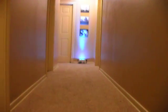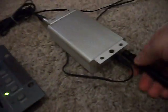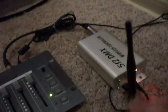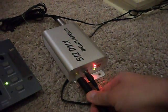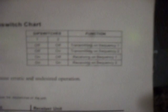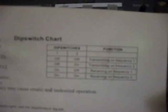As you can see we're operating the light. Now with the lights turned back on, I want to give you a closer look at the transmitter itself. It's really simple and easy to put together. You can disconnect the antenna and store it away for easy storage — it's quick to set up. The user manual explains there are two frequencies. You just set dip switch one to off and dip switch two to off to transmit on frequency one. For the receiver to receive frequency one, you turn dip switch one on and dip switch two off. It's just that simple.